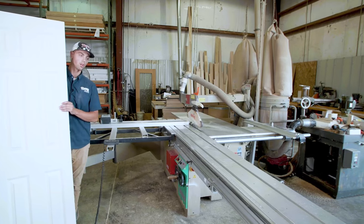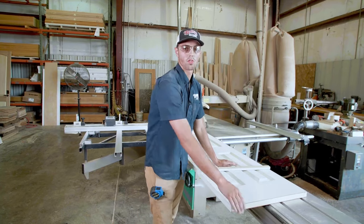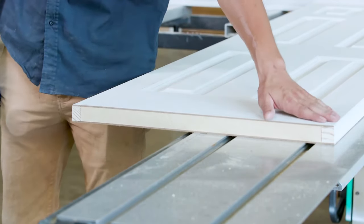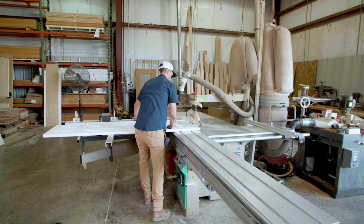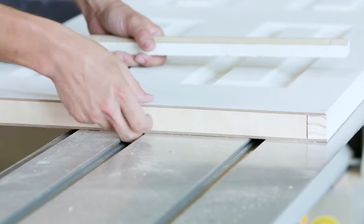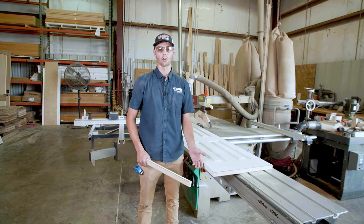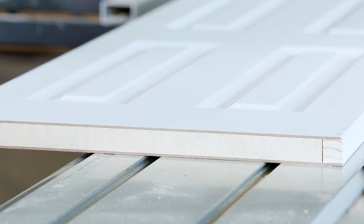We'll get it up on the saw, take three-quarters of an inch off, then bump it up to show the inside. The bottom of this door is still solid after the first cut — we haven't breached into the middle yet. After a second cut, unlike the hollow core door, there's still a solid chunk down here. So at home, if you were to cut this door down to replace a floor or add carpet, you wouldn't have to worry about corking it.